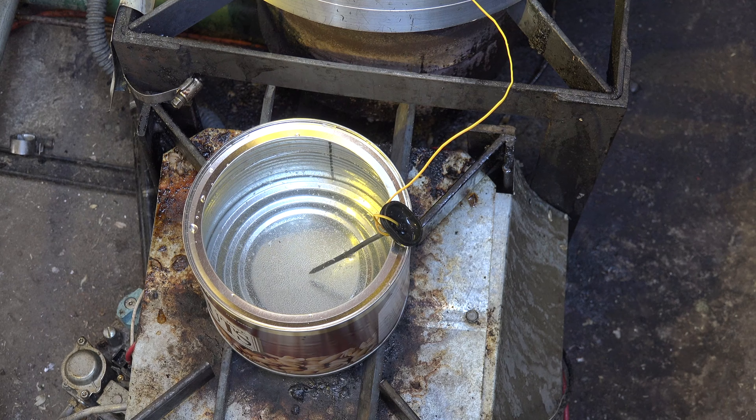What I'm going to do here is boil water. This is a latent heat experiment — I did this a few years ago but it wasn't complete, so I'm going to make this one more complete. There's about a 20,000 BTU burner underneath the water. When I boil that water it's going to start bubbling and stay pretty much the same temperature until the water is completely boiled away, illustrating that it is absorbing latent heat — that burner cannot heat the water any hotter than 100°C or 212°F.